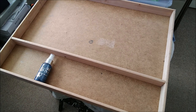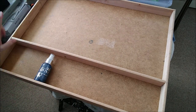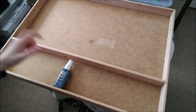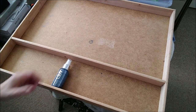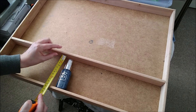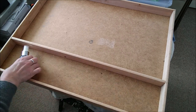I've gone ahead then and put the sides on as well and screwed them in at the back in exactly the same way as I did the top and bottom. And now I have cut little shelves for in here and I've measured them across. I want to put some mica spray in at the bottom, and those bottles are slightly larger than the other ones. And I know that the frame lip will come up a little bit here, and I need to leave a little area here so I can lift them in and out. So I've measured that, and it's exactly 13 centimetres from the bottom of this shelf to the top of this one. And that seems fine for right across there.